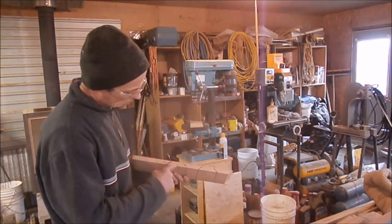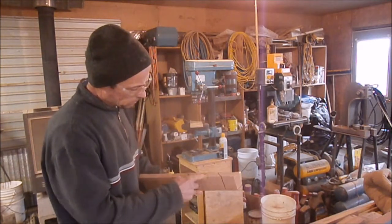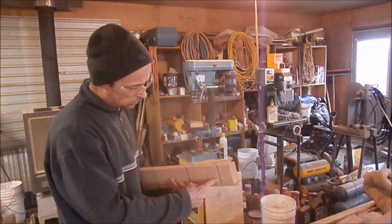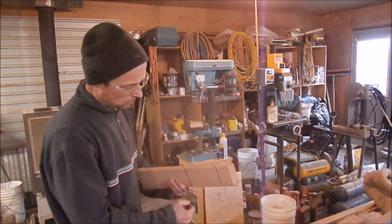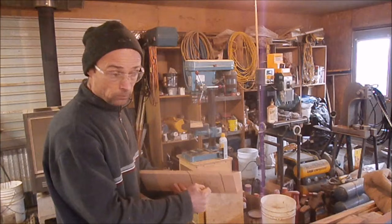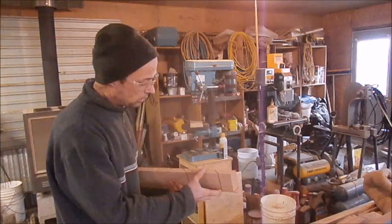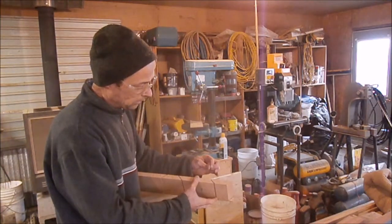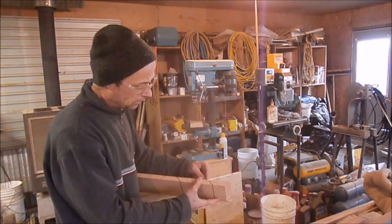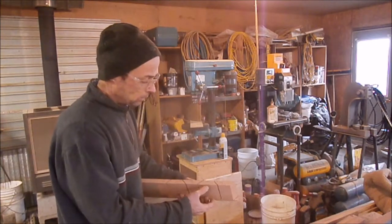These wedges, I've numbered them 1, 2, 3, 4, are going to be the pieces in which I screw the legs into and I screw into the sides. And that's what's going to keep that corner strengthened. Everything's going to be compressed. If the leg pulls in and I'm holding on to the sides, that means I'm pulling the leg into the dowel pins. So everything should be tight.